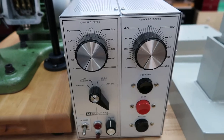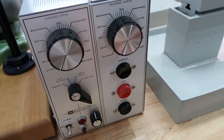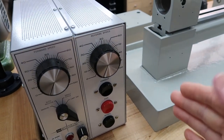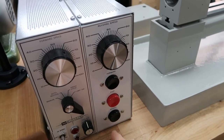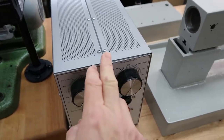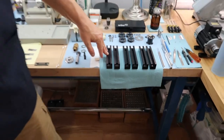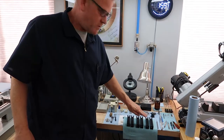These are speed controllers for forward and reverse, which are really important to have for quick actions. It's a really unique situation. When we're threading on the turret, we can stop it and go forward real quick. The threading system doesn't have an automatic disengage — we have to reverse the spindle. We can also adjust reverse speed independently from forward speed. Just real quick — these are the motor tracks for belt tensioning, just like on our German drill press and other machines. They can only do tensioning, not side-to-side adjustment.